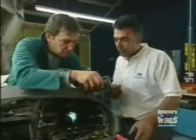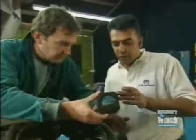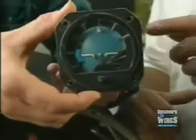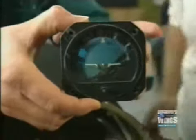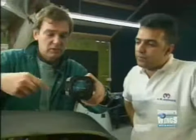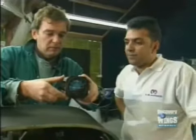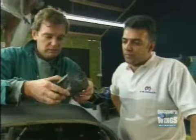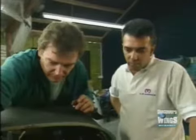The other one is an amazing instrument, isn't it? Sure. Again, that's a gyro there, but it's free-moving. It's not fixed like the DI. It's fixed in one plane. And this instrument gives you pitch and roll information, because the gyros here are basically in relation to planet Earth. They're in space. So wherever you go with this instrument fixed to your aircraft, this will always stay in the right plane. When it's set like this, it hasn't got the vacuum going, so it just sits on a tilt. Yes. It's only when the gyro is actually spinning that it will actually erect. So it's a superb, really clever bit of engineering. Beautiful instrument. Really lovely. So that's that. We've already got that one in there. So should we pop the DI in?